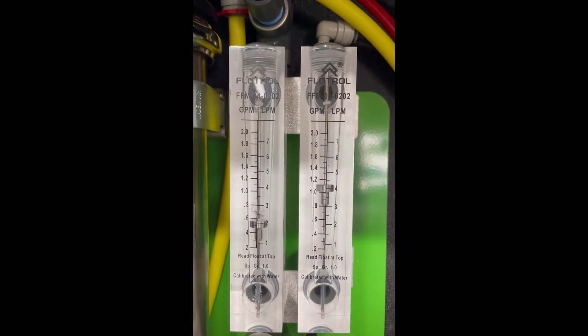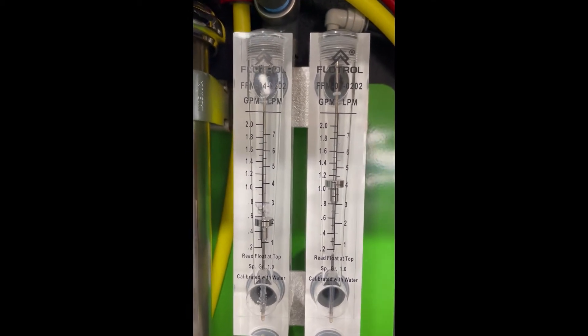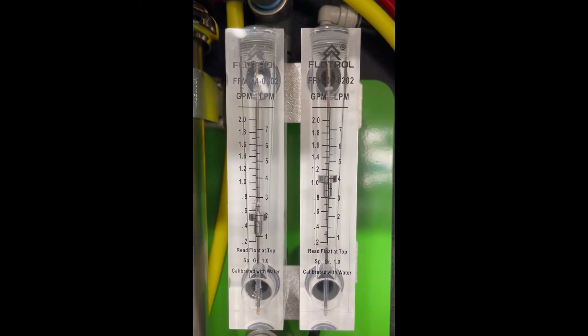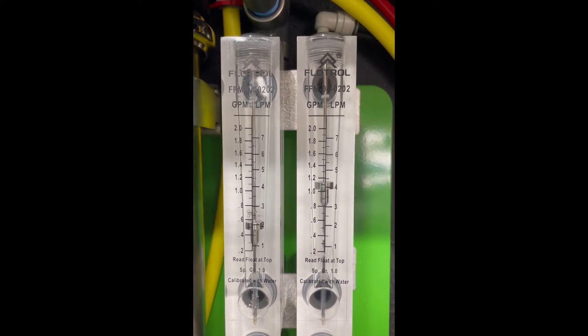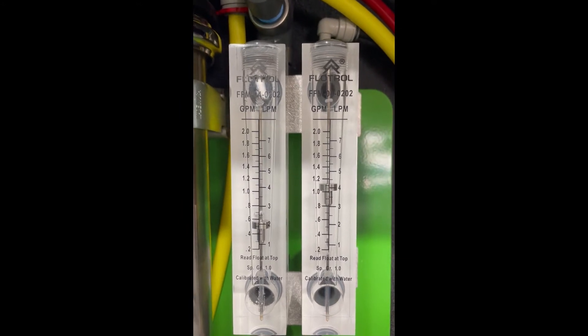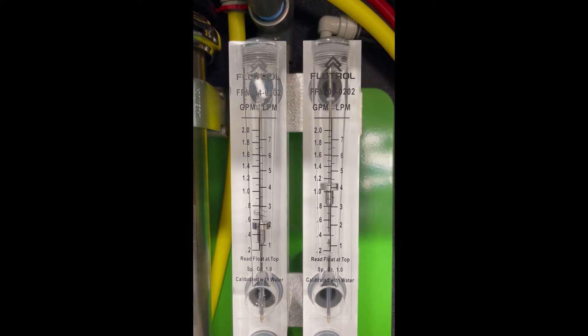On the right hand side we have the concentrate. Concentrate is the amount of water that we have to get rid of along with the minerals — being calcium, magnesium, iron, chlorine — the list goes on and on. We have a really nice cut sheet that describes everything that an RO membrane removes if you're interested.